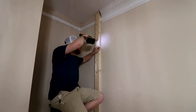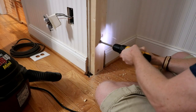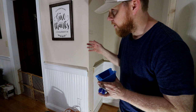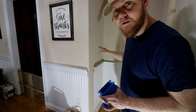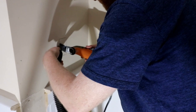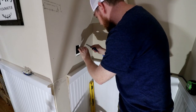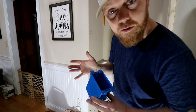I'm going to be adding a duplex outlet. Standard height on outlets and switches from the ground up is 48 inches to the top of the box. Since there are outlets on the other side of this wall in the kitchen, I'm going to mount this box at 44 inches to the top. I'm going to use an old work box. What that means is you can cut a hole in the sheetrock, put the box in — it's got these tabs — tighten the screws, the tabs flip up and pull the box tight to the wall, so you don't have to attach it to a stud.